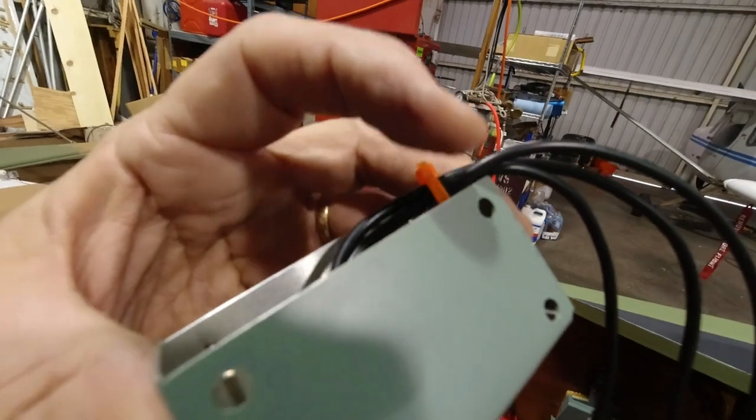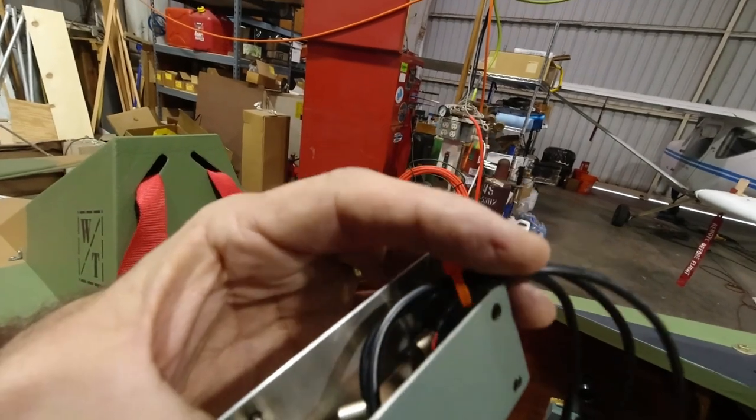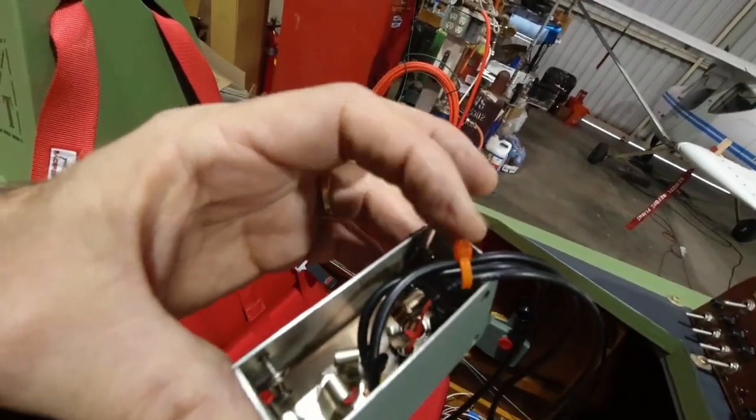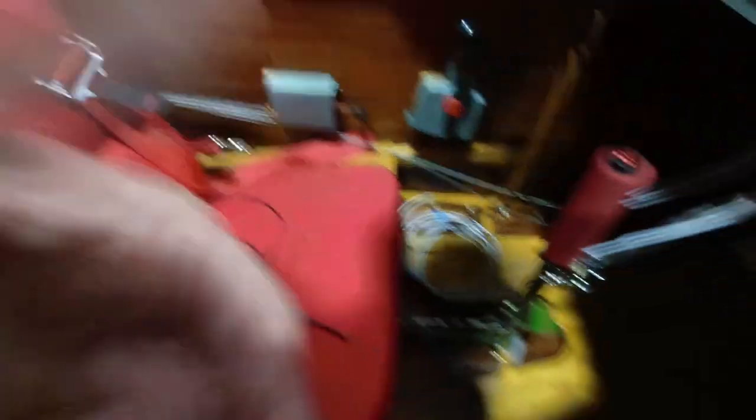The location of the carry-through pin — you can't see it here maybe, but it's way back here — so it will not be interfering with what's going on back here either. That's a good location. Once I get this screw in, I'll take a zip tie and zip tie all of these to this corner right here. I can't get the screwdriver in there if I do it first. Then these will be isolated and won't be able to flex and pull on any of the connections in here.